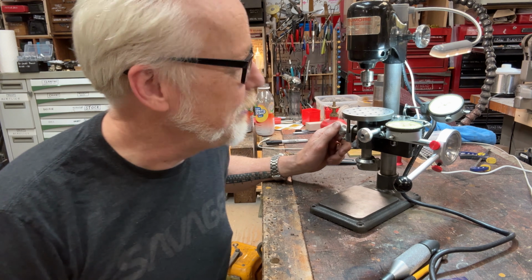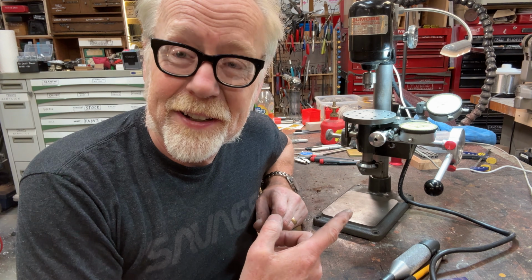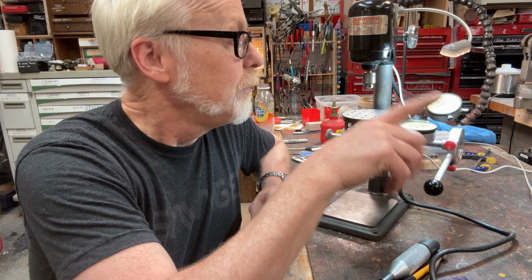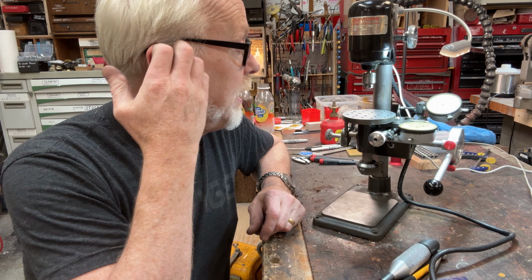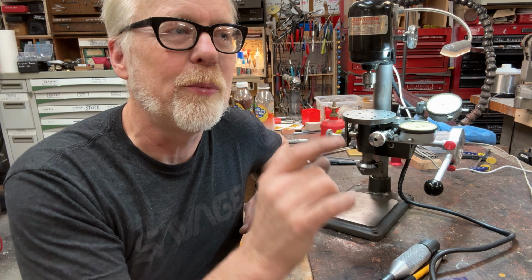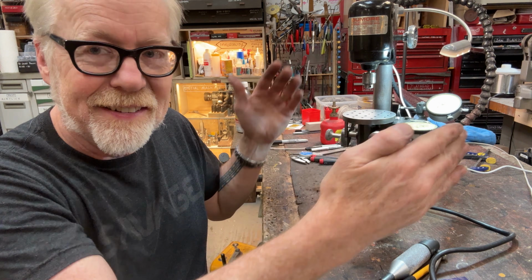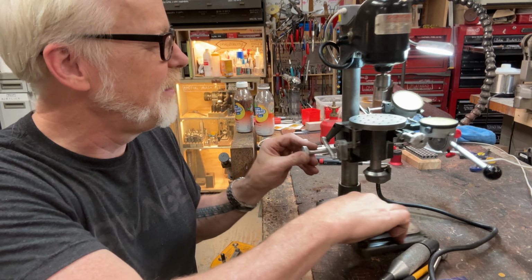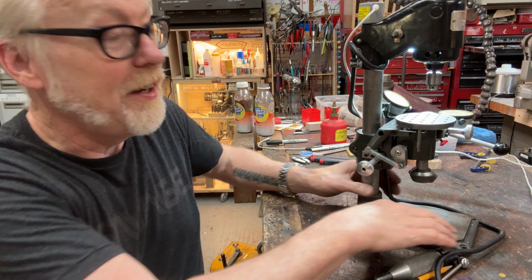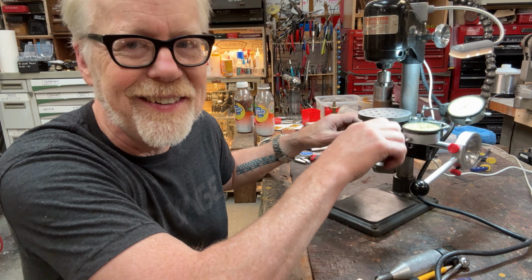All I had to do was open up, I don't know if it's going to be the same video or a separate video, but the lead screw for the X feed was bent. I had to unbend it. When it was unbent, it still had a little wobble, which shouldn't have affected the dovetail, but I still found it stiff. And then I realized that the little metal piece that it traveled through might be resisting it. So I opened it up like 5 thou, and it's perfect now. It's really easy to use.